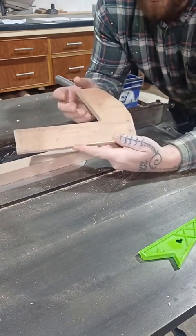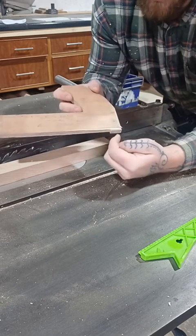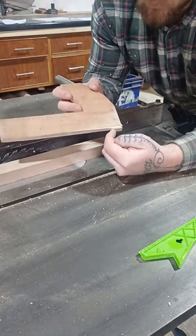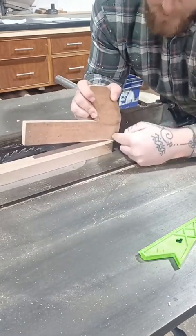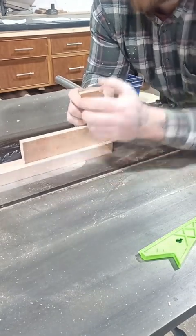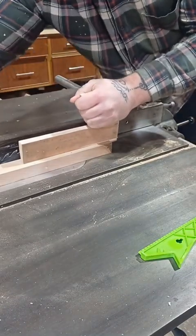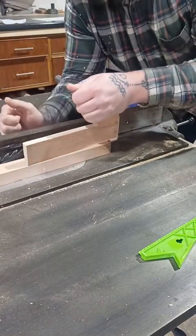Now this is just an offcut of ply. It's just a quick and easy 2-minute job to do. One thing that is important is having this little hook at the back here. So what that does is that pushes from the back of the wood, and then that acts as a fulcrum. So your pressure is downwards about 8 inches forwards. So as you're pushing it forwards, you've got downwards pressure. You see it actually forces the wood down. So it's got a lot more control.